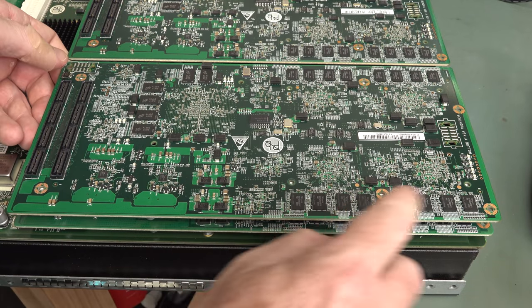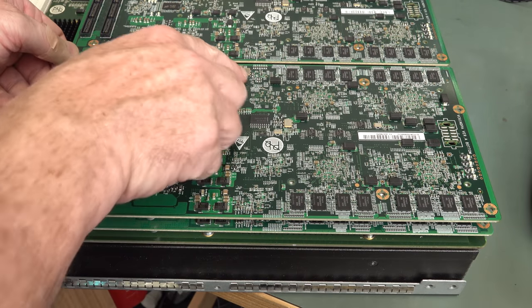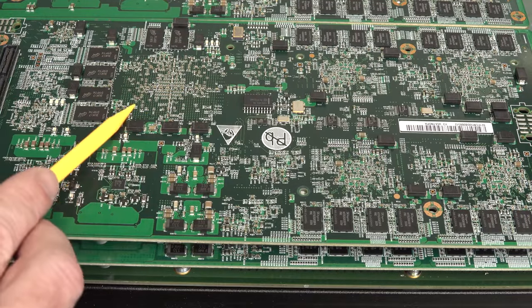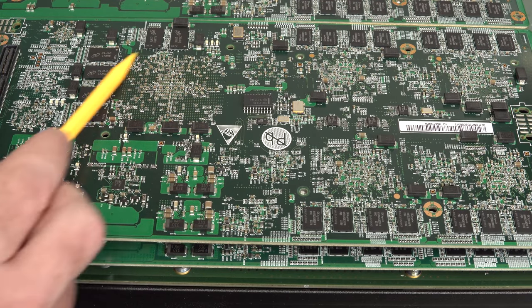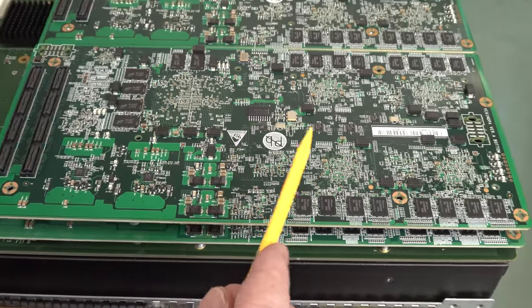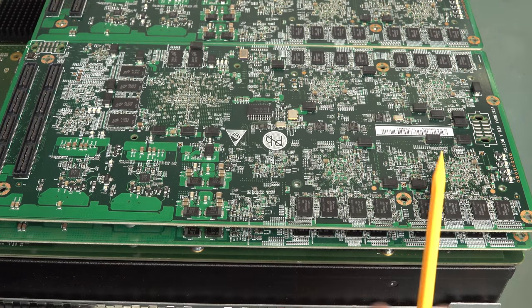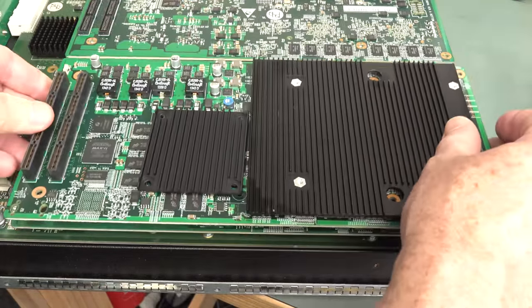And of course, we've just got a bunch of DRAM on the back and just some miscellaneous stuff, some local oscillator and other transceivers and housekeeping stuff. You can see here by all the bypassing and all the vias, a huge BGA, one of the 1000 pin BGAs, going to be some custom ASIC processor, video processor, encoder, decoder. Then another one, it could be an FPGA too, and then another one here, another one here, another one here. Well, geez, that's heavy, and we know why.